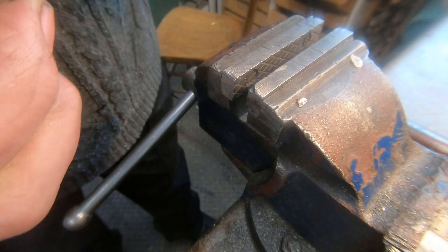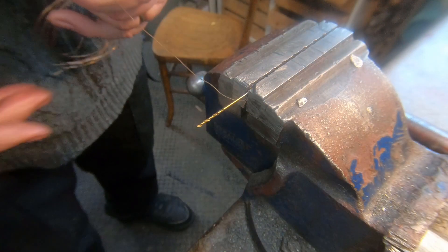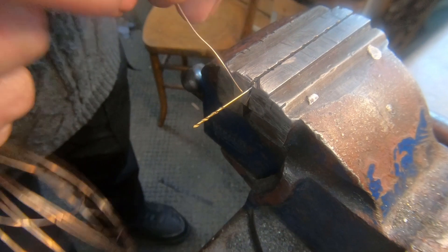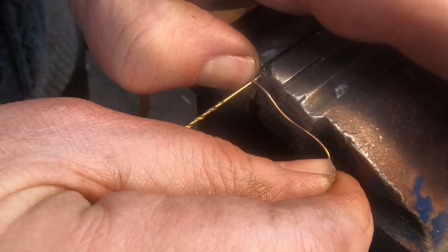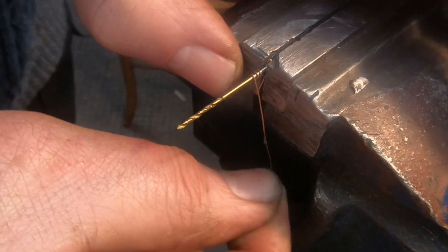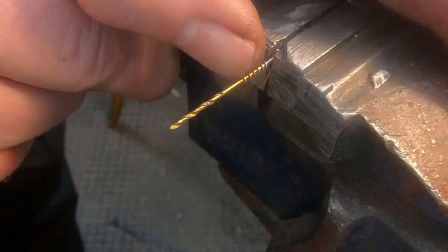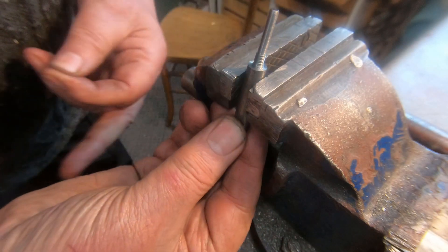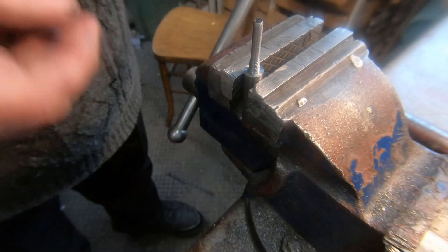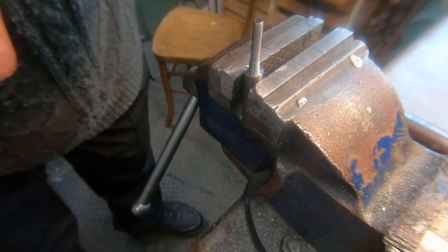As my form I'm just going to use a 1.3 millimeter drill. Put plenty of tension on and just start winding, trying to keep it pretty close and as even as possible. It's not perfect but I think it's good enough. This is the part I've just turned — just drop that in there, yeah, we'll trim that off.